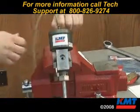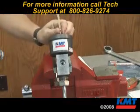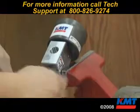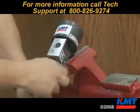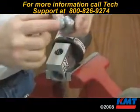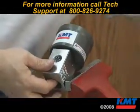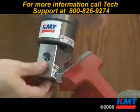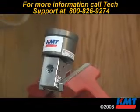Go ahead and take out the actuator assembly. Remove the valve nut and the nozzle tube. Sometimes the seat will come out with it, sometimes it stays up inside. You can use a strap wrench to break this loose if it's too tight, or sometimes it can come loose by hand.